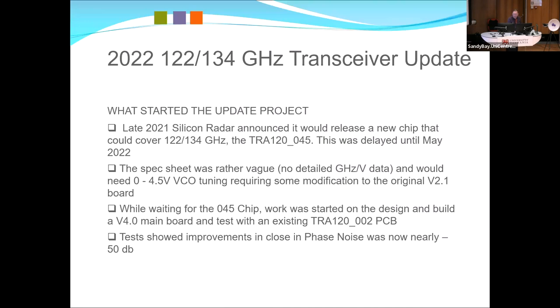And the noise figure of this chip is quoted as 8 dB, but that's theoretical. Comparing some of these, they were no better than a diode mixer, and that was mostly because of the phase noise and all the reciprocal stuff.